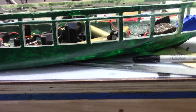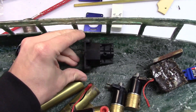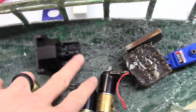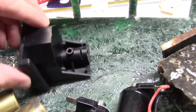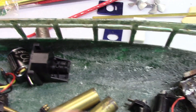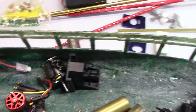You can see the hull curves in as you move aft. So if the motors were up here, they'd start going at an angle — which you could do. But at this location, basically where the shaft is going to go, it moves up, so if I get it to the point where it's level here, it's going down and further away from where the props are back here. So you'll have a lower angle, which is preferred.